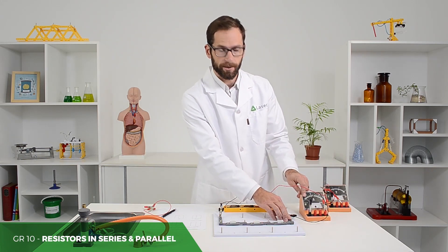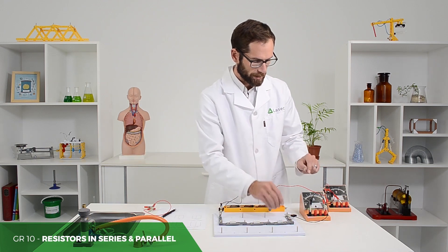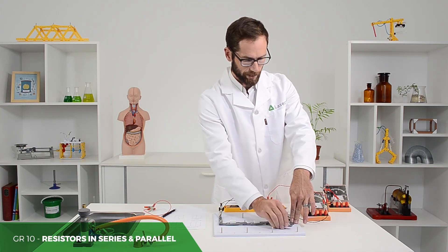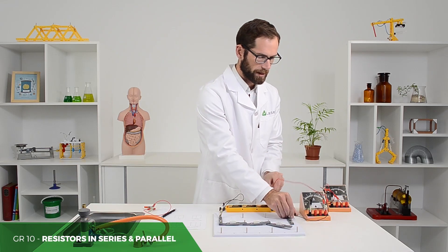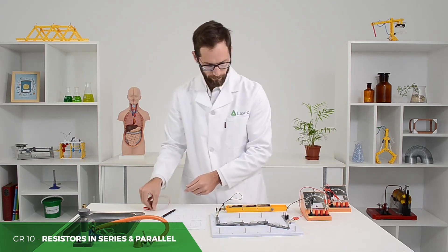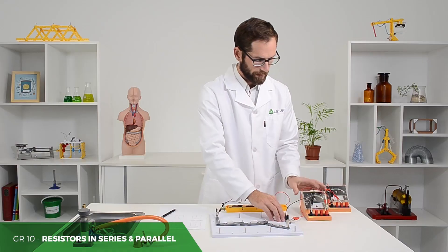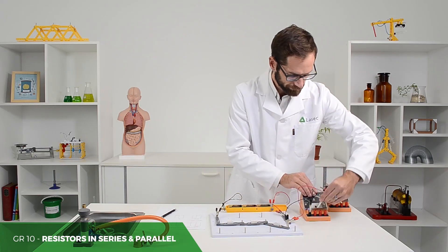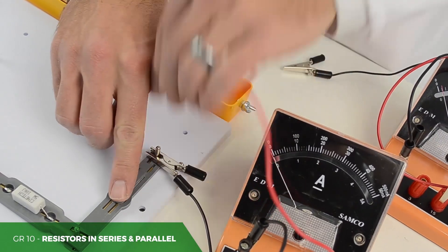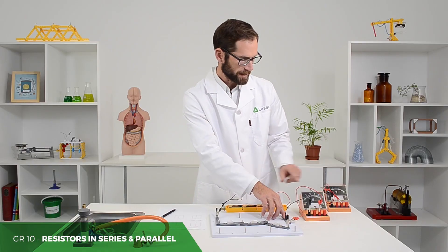Then we turn it on and we can get a reading. If that reading is too low, they can change which of the terminals they're connecting to. Over here, we're going to have to break the circuit next to each of these resistors in order to get the reading. So I'll have to break the circuit there, connect it up again keeping the polarity correct, and reconnect this part of the circuit here. Then turn it on and take the reading — I'm going to get a stronger reading here, so I can actually see a bit more of that needle movement and get a more accurate reading.